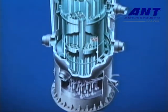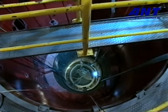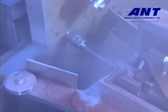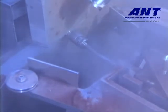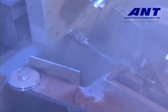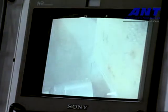Various dismantling techniques were tried out at the beginning — sawing and cutting, grinding methods were also applied. But now we believe we've found the ideal solution: water as a dismantling tool, a spectacular method. Hydrojet cutting six metres underwater. The five to thirteen centimetre thick steel of a ring-shaped component is being cut through like butter. The work is carried out underwater with remote control equipment for safety reasons. The water protects the personnel against radioactivity. Our cameras ensure that all working steps are monitored and that the hydrojet is positioned with millimetre precision.